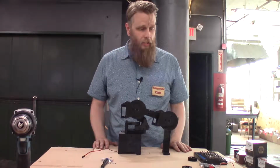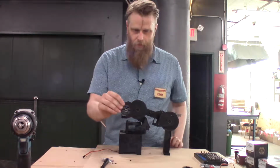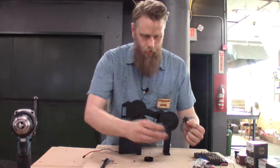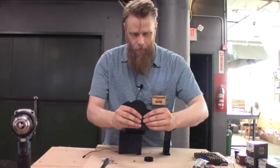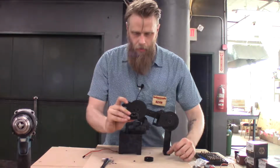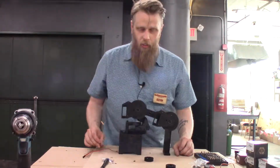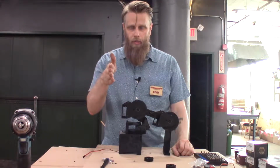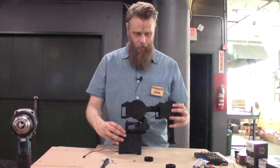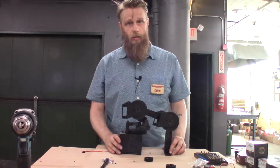Next step is going to be attaching the servos. So the servos have a piece of plastic, which is the horn here. This comes with the servo. This gets printed. These pieces go together like that. This now mounts to the servo, but before we mount this, we need to know where the servo's 0 point is going to be. So when it's in the middle, we want the arm to be in this configuration here. In order to do that, we're going to need the electronics next.